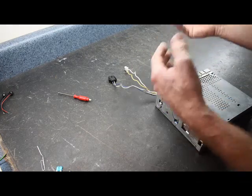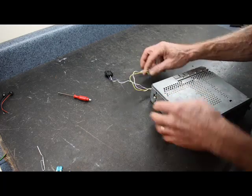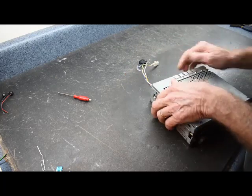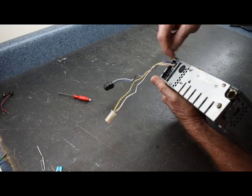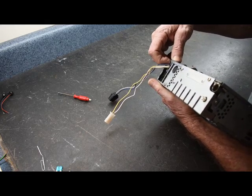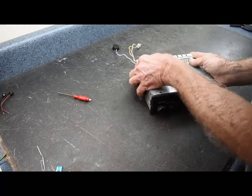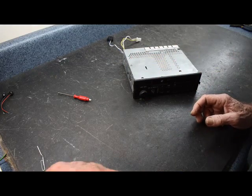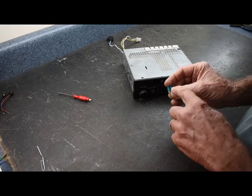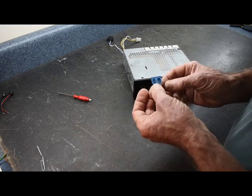Hooking the stereo up and testing power puts a load on the 12 volts. And we have seen that reading the connectors in the car shows 12 volts, but connecting the radio up and specifically testing the switched 12 volts, it disappears or drops down to 4 or 5 volts, which will not allow the radio to pop up. And the reason for this is, more recently they've gone to the blade type fuse, which is a miniature, and you can see the filament in the center. They miniaturized it from the previous size.